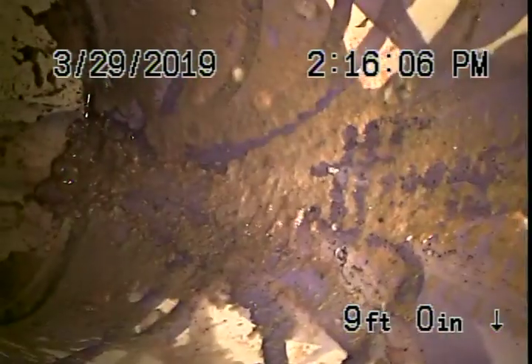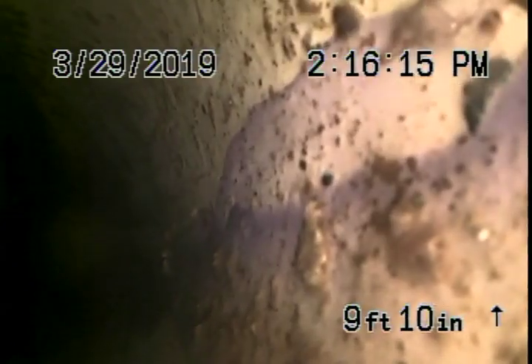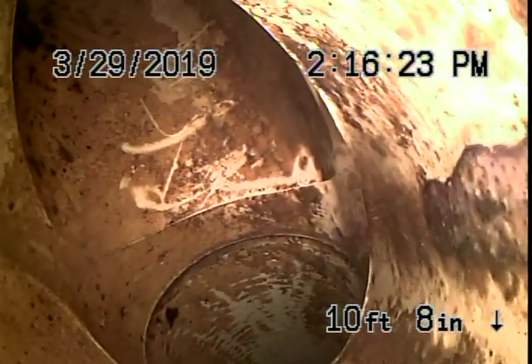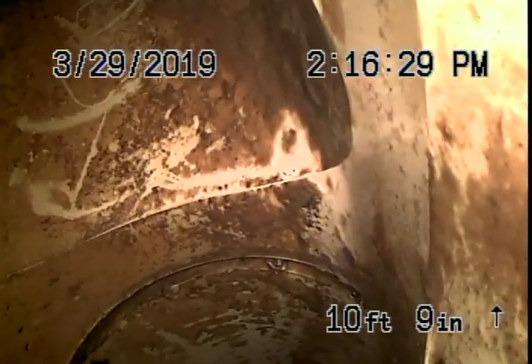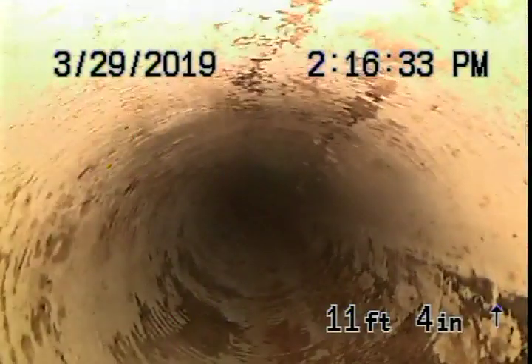You can see this hardened substance again in the bottom of the pipe — makes sliding hard. It's going to catch paper, slow down paper and solids. All right, horizontal now. This looks to be possibly a double santee on its side, with two inlets coming in the sides, and then we're going out.